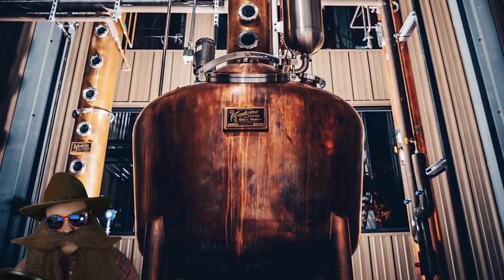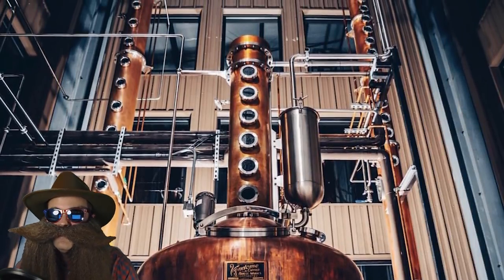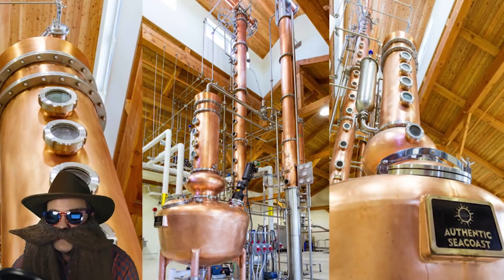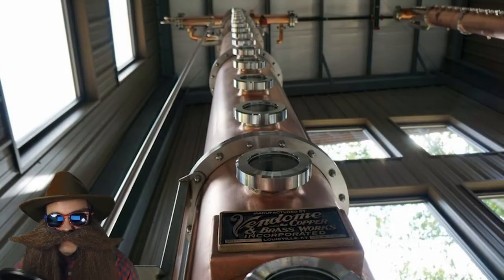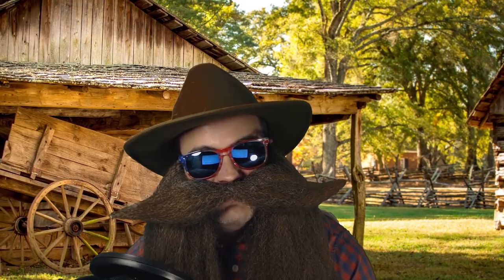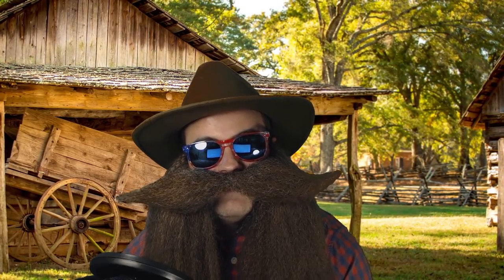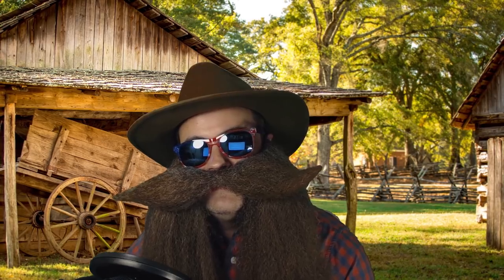Stills look better when they're not all covered up. We've all seen those impressive commercial stills, beautifully manufactured and polished up, with a whole lot of shiny copper going on. Most of the stills I've seen for sale don't come with insulation. So if the professional distiller doesn't seem concerned with using insulation, why should the home distiller? In an apartment on a sunny summer day, that still can really get things cooking inside. As the boiler is cooled by the room, you get reflux sticking to the inside of the boiler — that reflux doesn't go up the column, but instead falls back into the liquid below, decreasing the efficiency of your still.